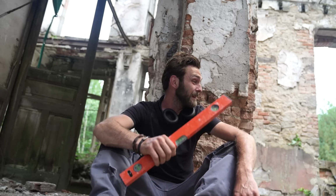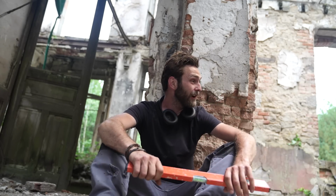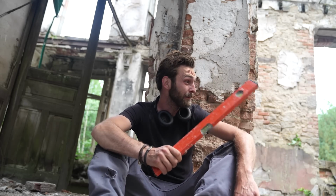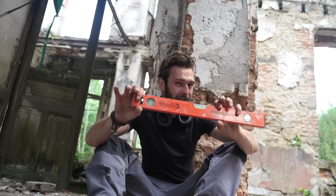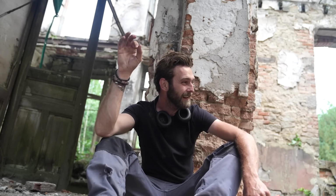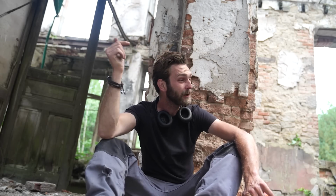Right, so that's the beams all level and straight. They're pretty square as well. I'm going to have to wait till nighttime to do the final adjustments with the laser, because with the spirit level you can get pretty bang on, but I just want to take the opportunity to get this millimeter perfect. Having a dead straight floor is a benefit in future. So while it's like this, it's going to be easy. I'll get the levels, and then I can cement them in. So I'm going to paint them now, and just get on with other stuff until it gets dark enough.